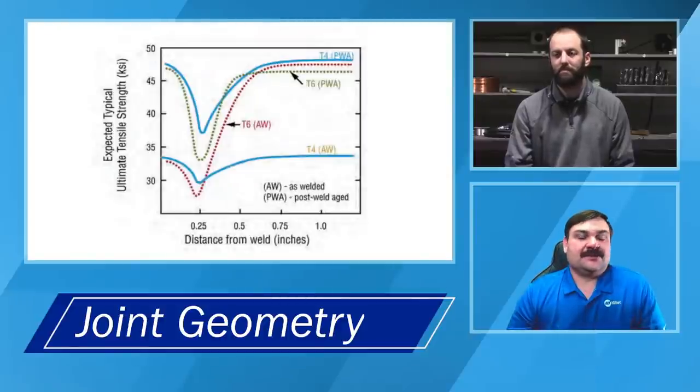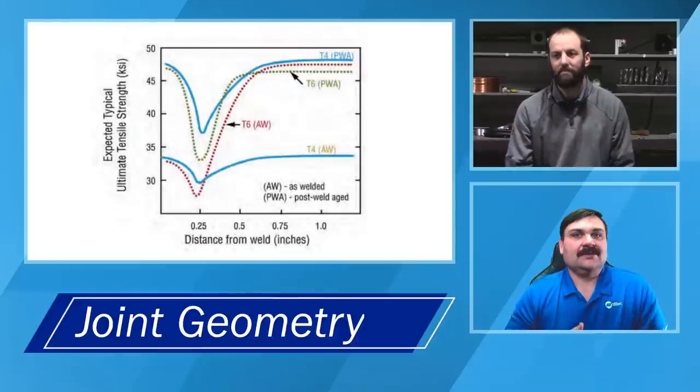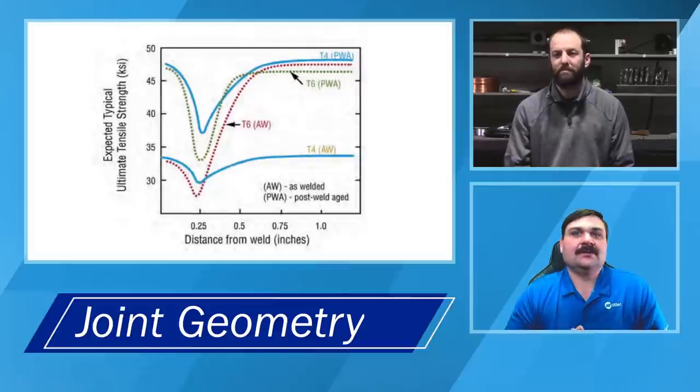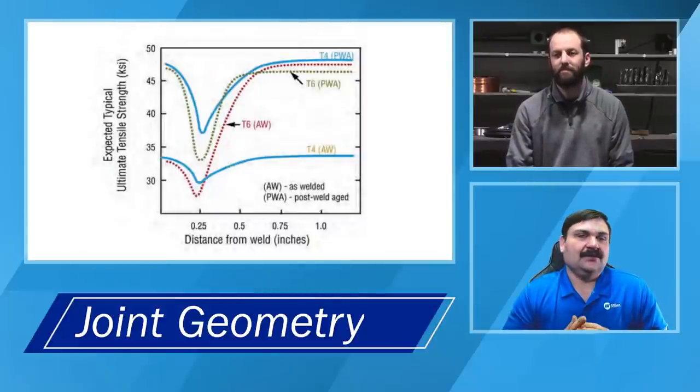If you've got something more specific, you can email us that one. But that's going to be a common thing, like Andrew had said too, where you're losing that strength around the weld, where aluminum trailers have a life cycle where they're going to start cracking. And when they start cracking, you're going to start chasing cracks forever, because you get a crack, you weld it, and then you get another one that shows up right next to it. So some of that stuff is pretty hard to catch up to. It's just going to be the nature of the beast. But as far as the cleaning side of things goes, hopefully that will help. Again, back to the older stuff, if you have more of a question there, feel free to email that in to us and we'll try to help you out.